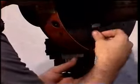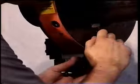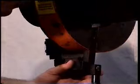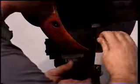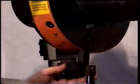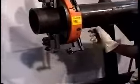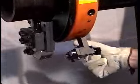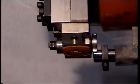The trip assembly will be attached next. It should be attached so it properly engages with the outermost portion of the star wheel. The trip assembly is attached with a 3/8 shoulder bolt. Each trip assembly has locating holes so that the star wheel and trip engage properly. Proper height of the trip assembly is determined by slide location and slide length. With the trip engaged, the pin should be extended far enough to fully engage with the star wheel but not contact the tool slide gearbox.